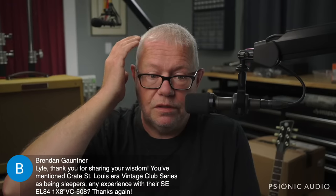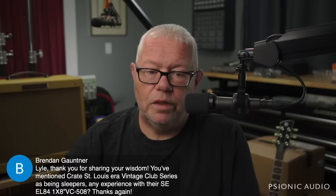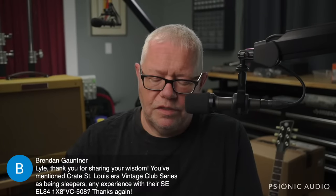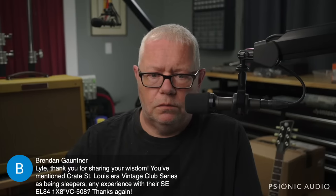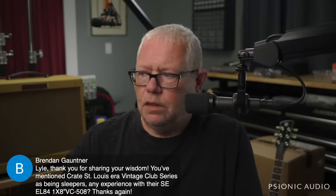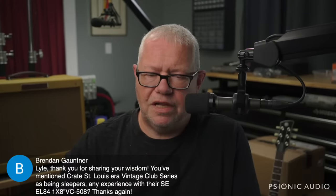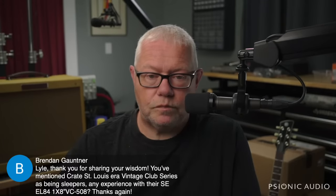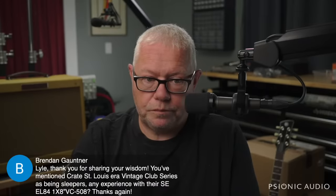Yeah, the Vintage Club series are sleeper amps. I have no experience with the single-ended VC 508. Sorry. I would hope that it is designed by the same guy. Because if you look inside one of those things, you're like, all right, good WIMA box caps, radial caps used properly. There are things done to meet the budget, but it's got 16 millimeter pots on the board, not 9 millimeter. It doesn't have the little plastic D-shaft things that a lot of companies did at the time. So I hope that the SE version of the VC series is good, but I have not played around with it.